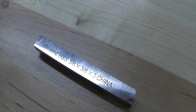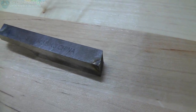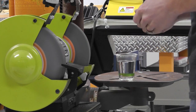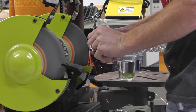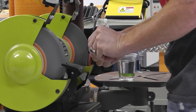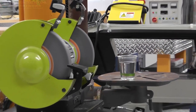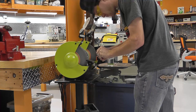So here we just grabbed a regular piece of high-speed steel used commonly for milling or turning. Most of the time these pieces are used and then thrown out, but you can always recut these things and make new parts — which is exactly what we're going to do right here. First things first: we got ourselves a glass of water and a bench grinder. Now, first thing to note is that this is not a tool grinder — it'd be nice if I had one of those, but I don't. The water is just to keep things cool. Don't forget: safety first. Safety glasses, yes. Gloves, no — gloves are actually a bad thing in certain applications such as drill press, milling, etc. You don't want to wear gloves when doing something like that, only when handling the pieces after you do the machining work. So we'll grind this at an edge and that's it.